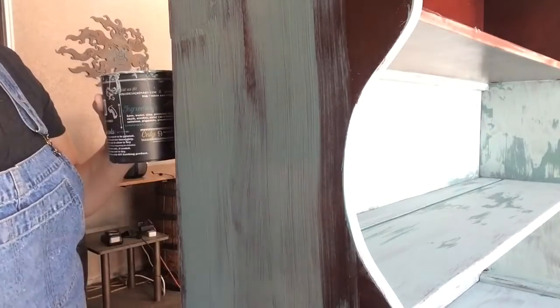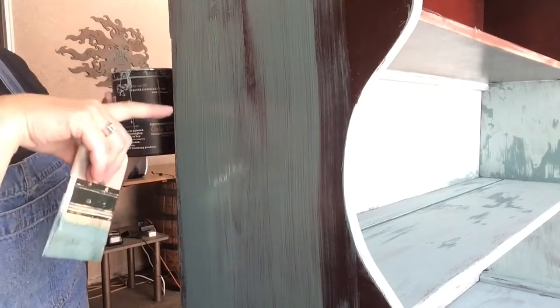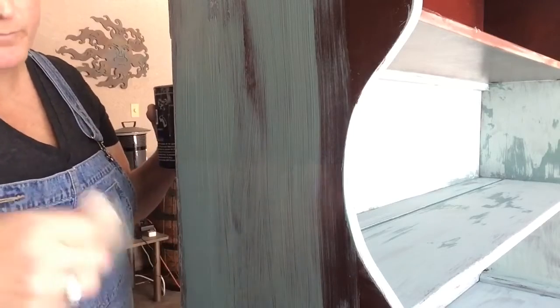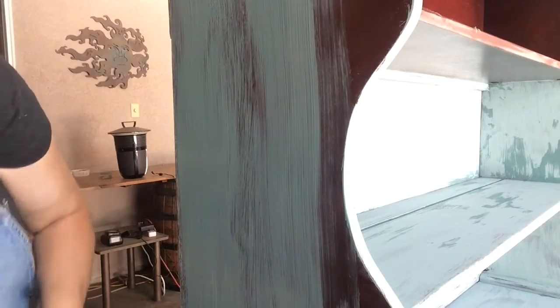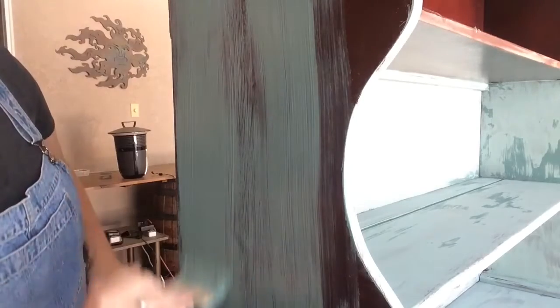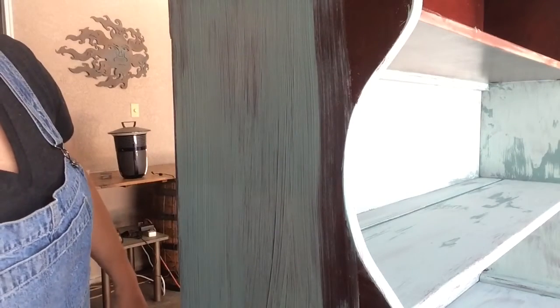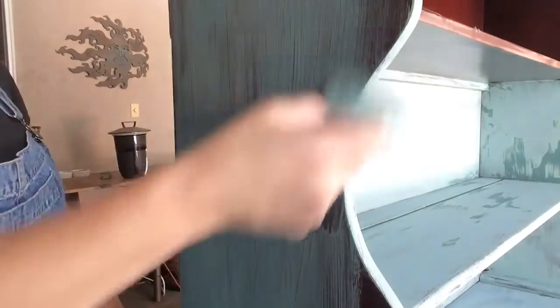Yeah, now I've made perfect coverage, right? Probably don't even have to have another coat. The problem is now I have deep brush strokes that may or may not settle on their own. So, because I don't want those, what I would need to do is apply the water. Now I can take all this paint off and pull it up off there and cover the rest of this piece on this wall. And I can come down here and just brush it slightly.